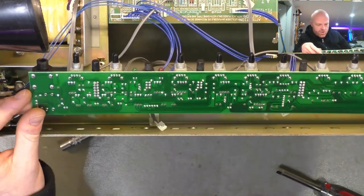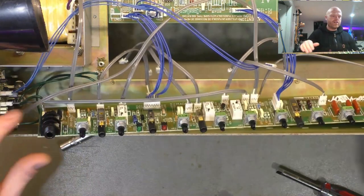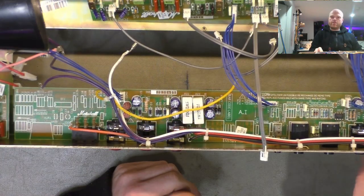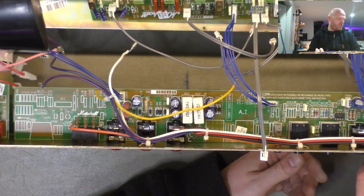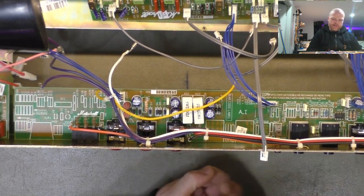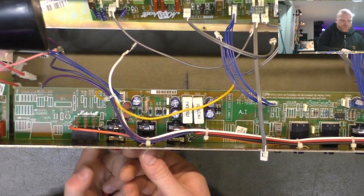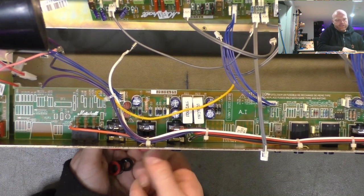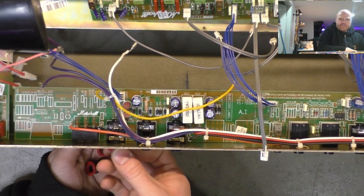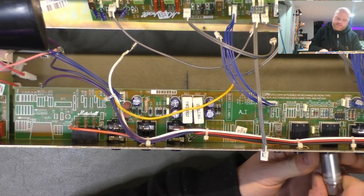As for the rear board, we'll clean up those areas with the heat and go from there. Just remove the foot switch jack nuts. So instead of relying on pots for mechanical support of this board, it's relying on the jacks. Speaker jacks, you know, the ones that if they lose their connection, you get a flyback event, those ones. 9/16 socket for the effects send and return.